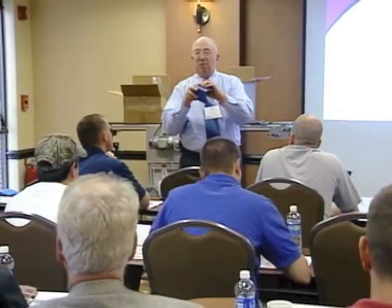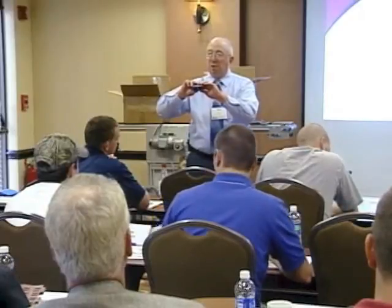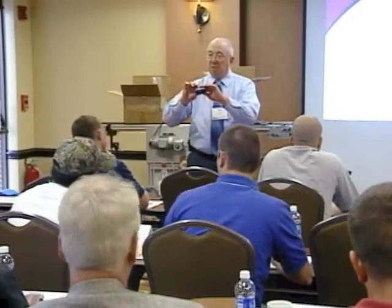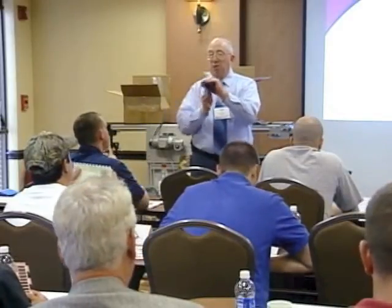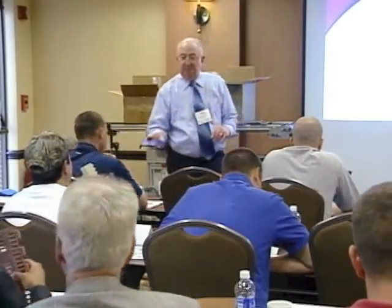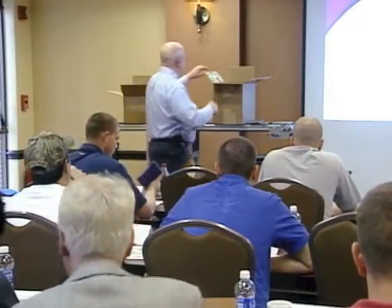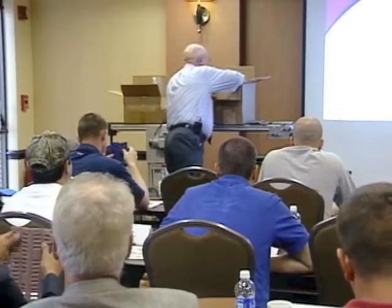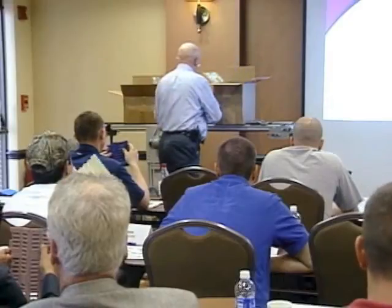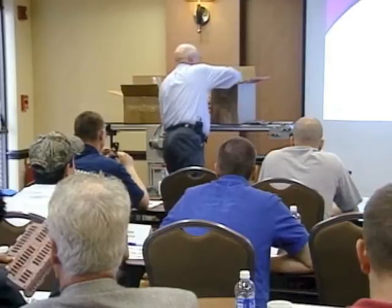One of the other things, talk to the manufacturers, but they will generally tell you that the diameter of that nose roller should be at least 1/8 inch more than the pitch of the belt. The reason is it will make a smoother transfer and you don't get the noise. One of the downsides to modular is noise, because it will click, clack, and what have you. There is a great advantage to doing close transfers, though, with the modular belt. It will work in that way. You'll see some pictures later of that.